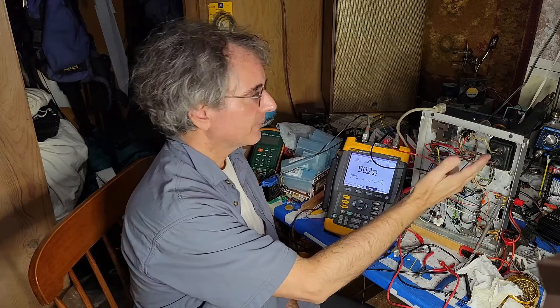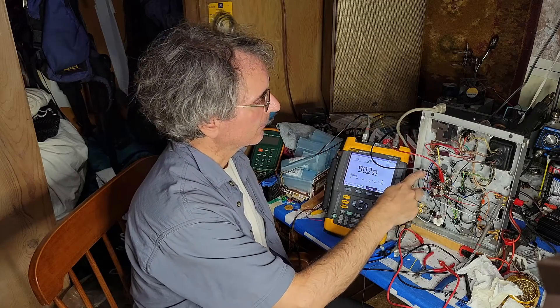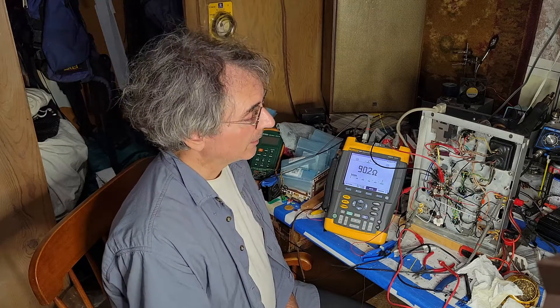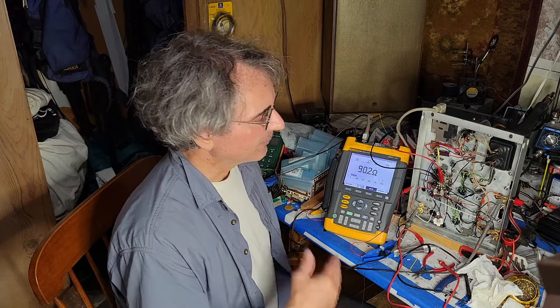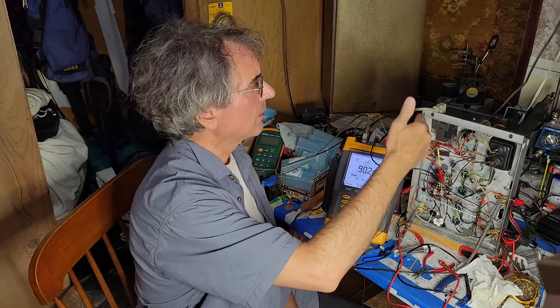Well, 40 times 4 is 160, which should be manageable, but the biasing on the triodes requires another 16.6. So that's just in there. What I've found is that if I bias it with the resistor values that Morgan Jones calls for in his design, the B+ goes too low for the regulated supply to stay in regulation.